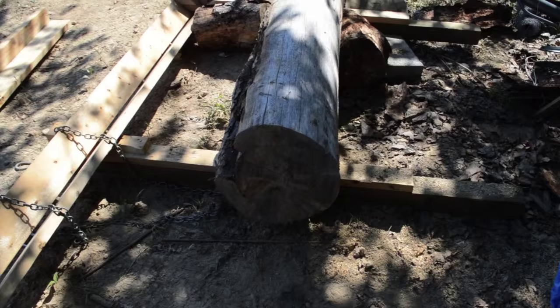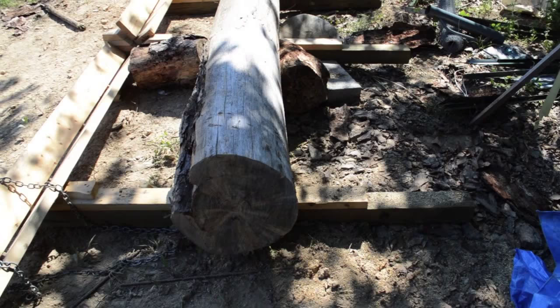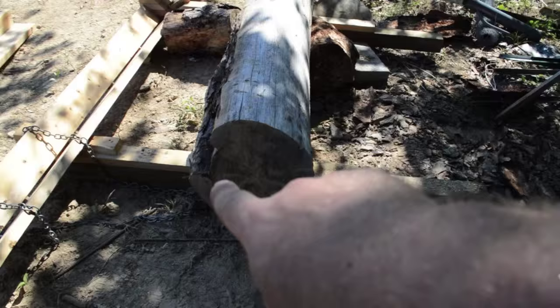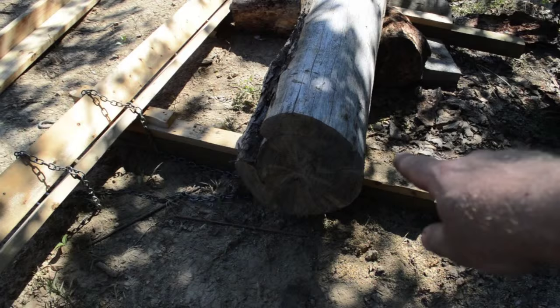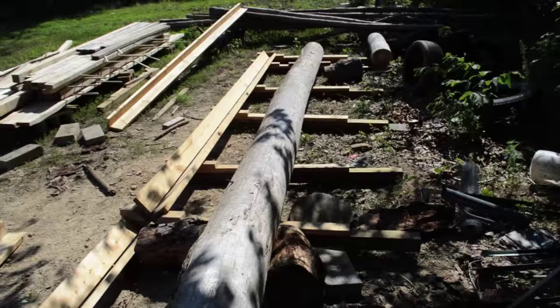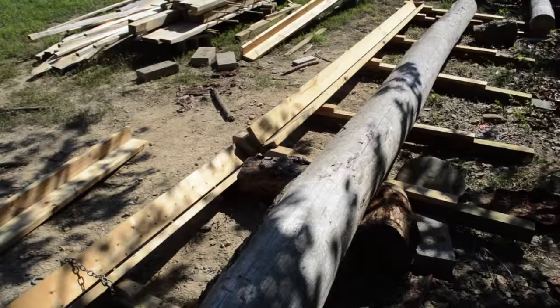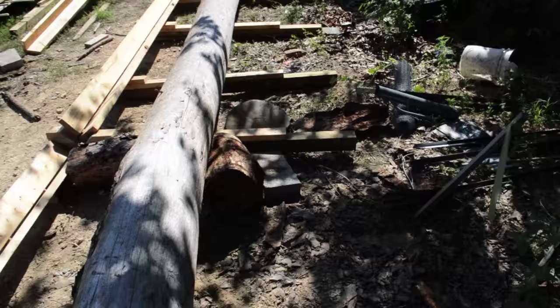My log is oval, not round, and there's an ugly spot on it. Even though it caused extra work, I put it with the oval facing upwards — that's because the bandsaw mill can only cut so wide, and cutting that piece out now and squaring it up lets me get a bigger bite when I cut the sides. If I flipped it the easy way, it would catch in the sides of the bandsaw mill. Now I just have to tap the rail in place, screw it in, put the L's up against the 2x4s screwed into the 4x4, secure the log, and I'm ready to cut.